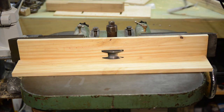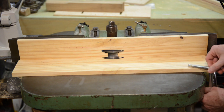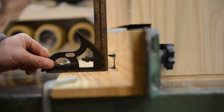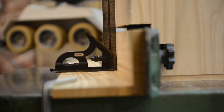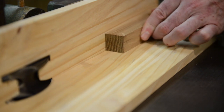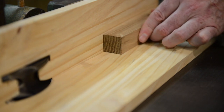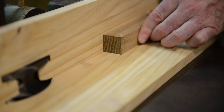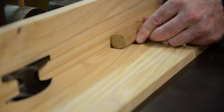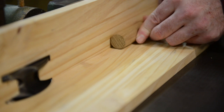Because I didn't have any table rings with the perfect geometry for the cutter, I added a false bed clamped securely to the table. I'll check the fence to make sure it's still square before carrying on. We'd be all set for machining square or rectangular stock at this point, but since we're producing round products that will effectively only have two points of contact, I decided to make some featherboards.